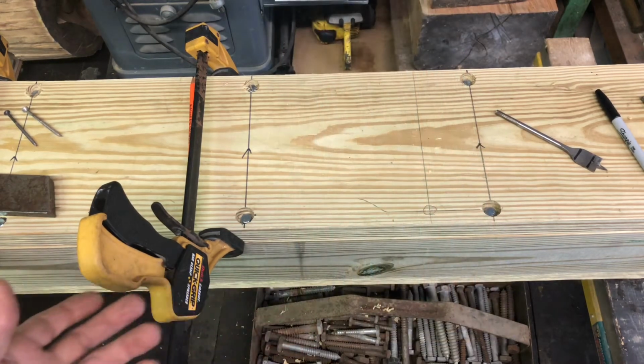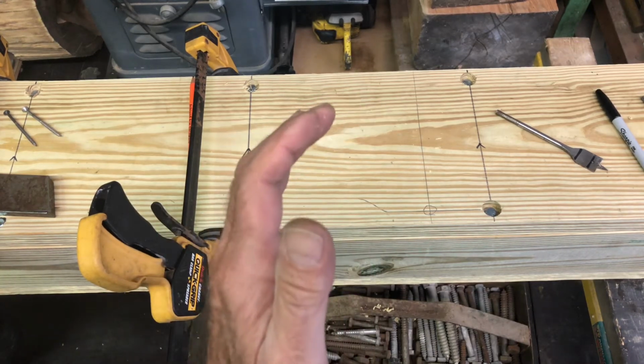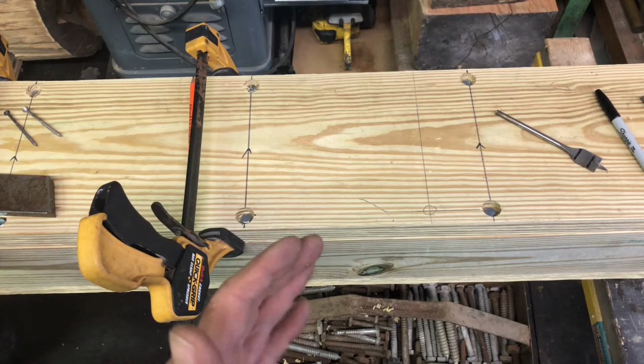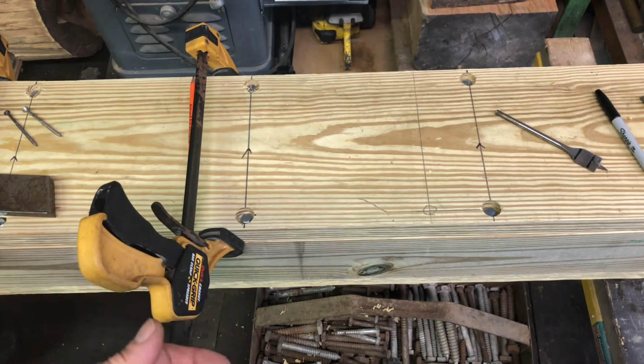You're also not always going to find boards that are perfectly straight. So if there's a little bend or crook in the end of it, in the last 6 or 8 inches, you may well just be cutting that off and coming to terms with the fact that there is typically a minimum of 10 to 15% of waste anytime you're buying wood products like this. Unless it's an engineered material, where those percentages might go down a little bit more.